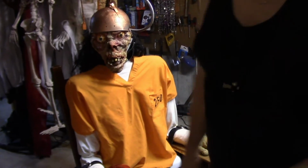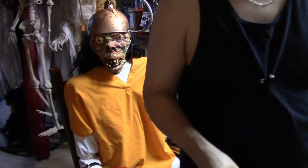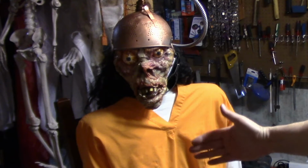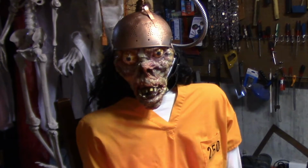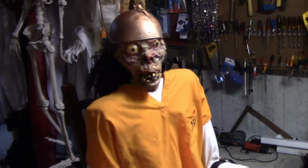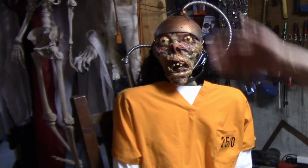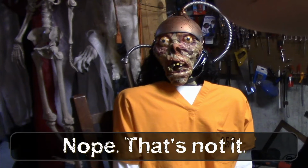All right, so I changed the spring out from this to something quite a bit bigger. Similar to this one here around his head. Same size. It's giving a better result. This is him now at full forward, where he was leaning way forward before. So this is keeping him from coming all the way out here. And still the motor dies anyway, the circuit dies. So the spring is probably putting too much torque on the motor.